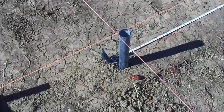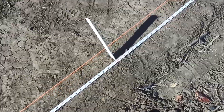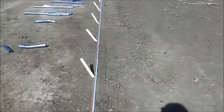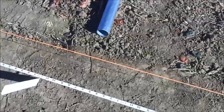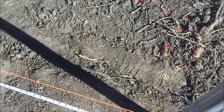Now that we got our corner posts in, you can see they're not touching the lines. Every four foot is going to be our layout here. We got each one laid out at four foot, and I just stuck a little spike in there so we have something to mark. We measured around the edge of the corner posts, and as you come down you hit that four-foot mark — that's where our poles will go.